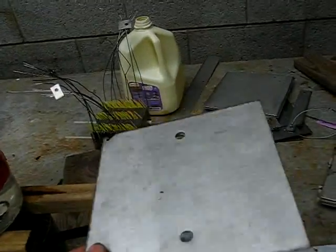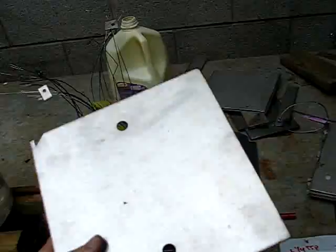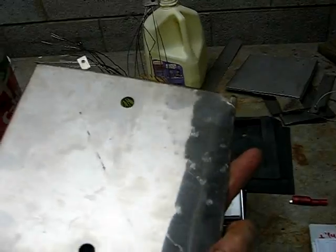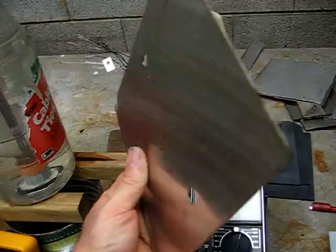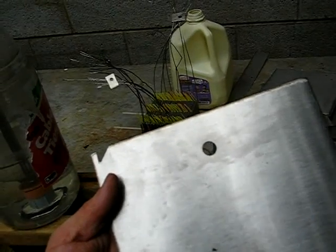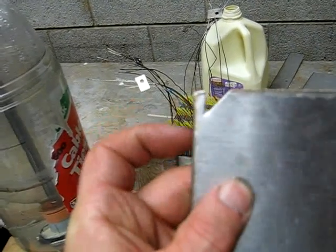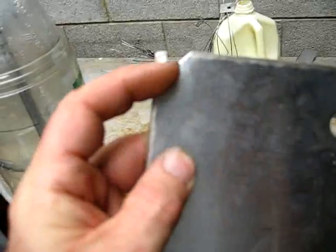This is a rejected plate — I could have made it work, but it was extra. It's stainless steel kick plates, eight inches wide and thirty-something inches long, and I had one that was about three feet square. I cut them all up, drilled the holes — which wore out a lot of drill bits. Those holes are about seven-sixteenths of an inch. Then with tin snips I cut notches in the corners and left a quarter-inch stub to put the electrical connectors on. The neutral plates I just cut that all the way off.